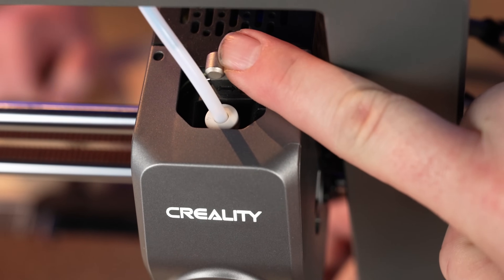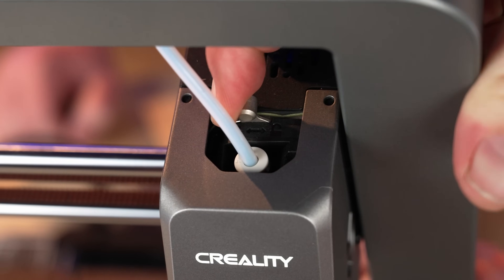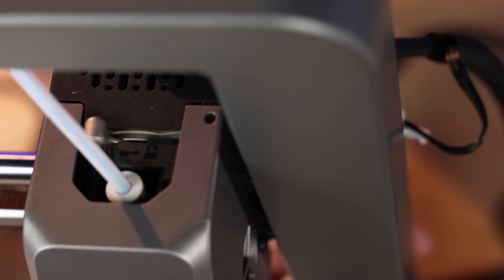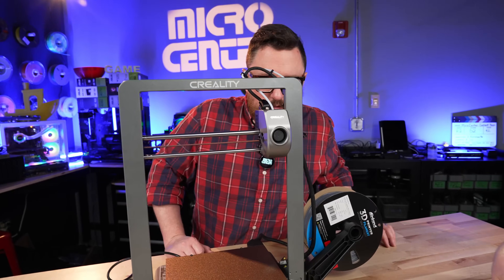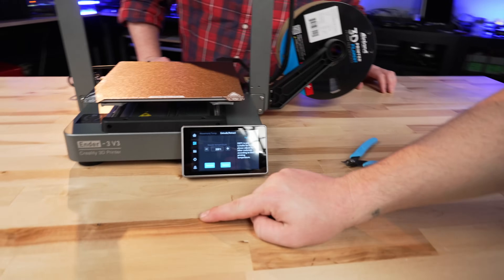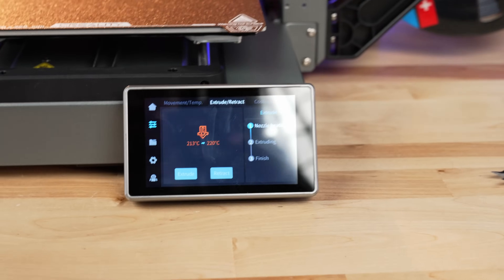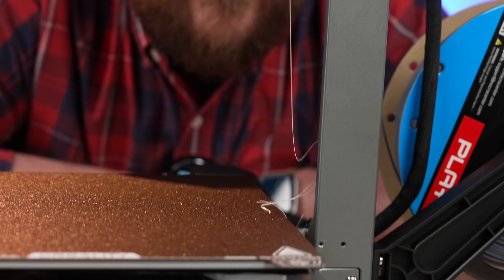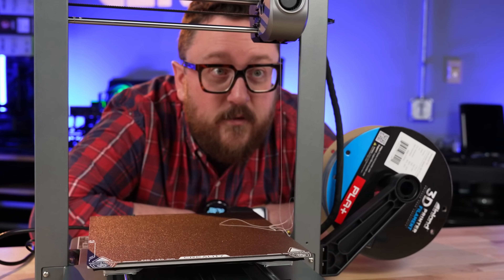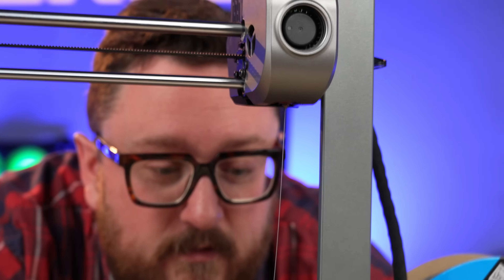We're going to put the filament on with it coming underneath. This is the runout sensor - we're just going to slide that up into that Bowden tube, keep going until we get up to the head. We're going to make sure that the lock switch is in the unlocked position so we can get the filament into the correct position. There it goes - I felt it. Now we can lock it. The extruder is holding onto it. We select extrude from the menu and extrude some. That's the filament from the factory - they tested it with a different color. Right now we're pushing out the old stuff and we've got some gray starting to appear. We've successfully loaded filament on the printer.